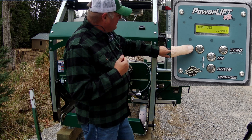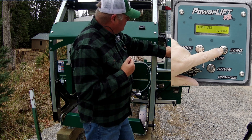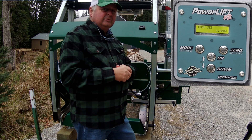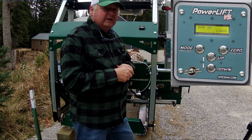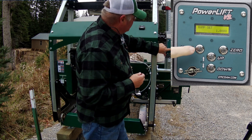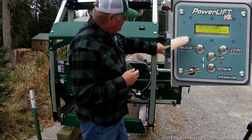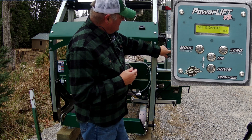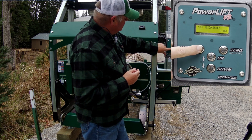After making your selection, you push select/exit and it will reboot and save that setting. So then you're permanently set to one inch — next time you turn the power lift on it'll be set to one inch. If you press mode you go to the next setting, which is setting the big bump. Like I said before, it defaults to six inches; same process, you go up and down to change it.